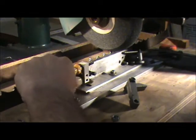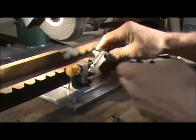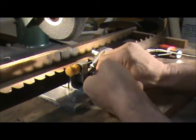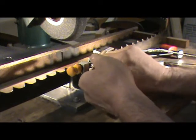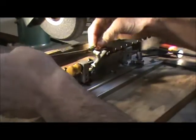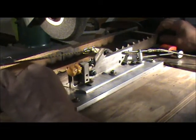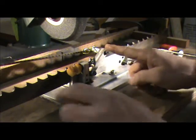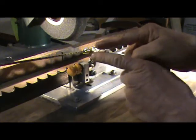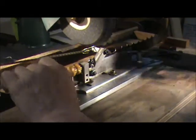This is my indexing finger — it simply slides onto that threaded bolt and I put a nut on it to keep it in place. Then I take this little bungee cord — a rubber band would probably work fine too — hook it on here and back here, which just biases that finger up so it'll drop into place. This stop screw bears on the back of the finger, either pushing it forward or allowing it to go back, positioning the tooth in relationship to the wheel. Get it where we need it.